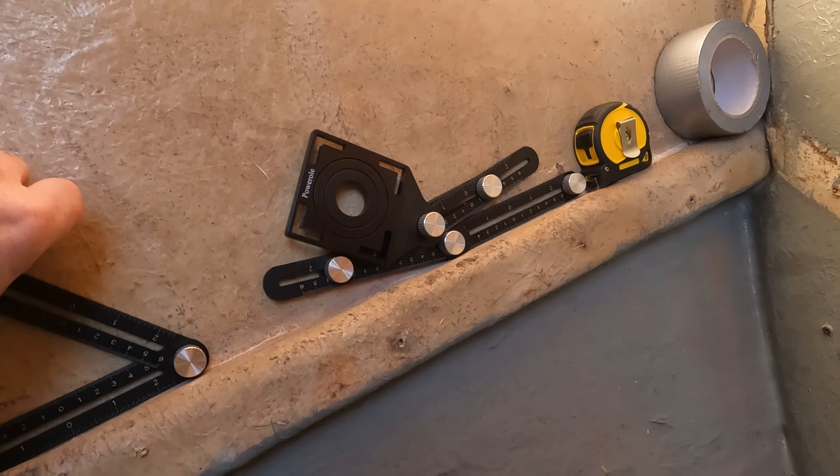That's a good fit - it'll be screwed and epoxied in there as a shelf to support the stringer. I think for that size space there'll be two stringers along the sides, but the next trick is going to be working out how they're going to fit into that little space up there. We've got the first lot of fiberglass on - two tab strips all the way around and then two sheets covering the bulkhead and going onto the sides. We feel we were a bit too stingy in how far they come along the sides, so we're going to add a strip down each side - the top was fine - and we'll make it come a good six inches along the hull each side.